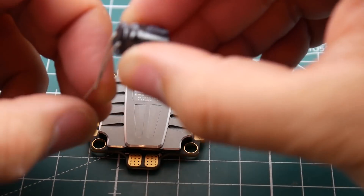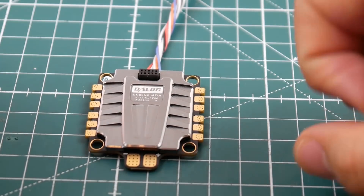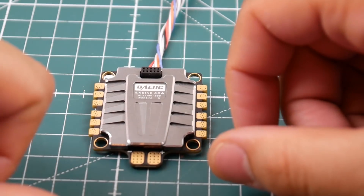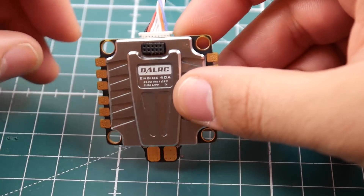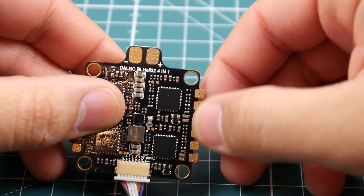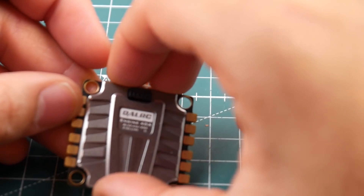The packaging is actually very nice on this ESC. They also provide a Rubicon low-ESR capacitor, which is interesting. From the specs, it has a built-in low-ESR capacitor array up to 1150 microfarads — so basically a 1000-microfarad low-ESR capacitor is built into this ESC, and we'll see how well that performs. The quality looks very nice — it seems like it's made very well. The battery pads and solder pads are large and look very easy to solder.